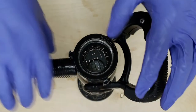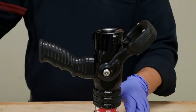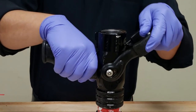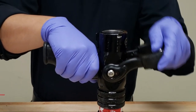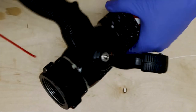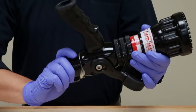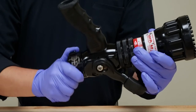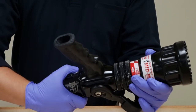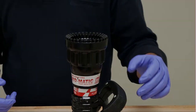Now we move to the back of the nozzle. First, with the bale fully open, apply lubricant to the back of the slide valve and move the bale back and forth. Finally, apply a small amount of lubricant to the back side of the coupling where it meets the valve body. Even when well lubricated, this coupling should still require some effort to turn. This is sealed by an O-ring so that under pressure the nozzle can still rotate on the hose line, so in most cases this will not be a free swivel.